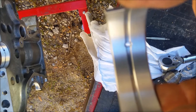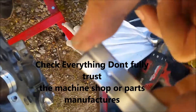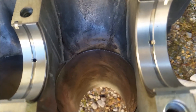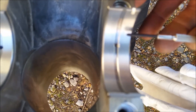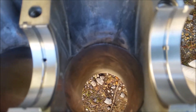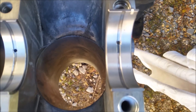Inside that hole where the oil comes out, there was a little burr. It turns out when they bored that hole it created a little piece of metal off the drill bit. I cleaned it up — there it is right there. There was a bigger shaving that came out of there. You've got to be really careful because the oil would have pushed that into the bearing and it would have been scoring the bearing up, and you definitely don't need that on a new motor.